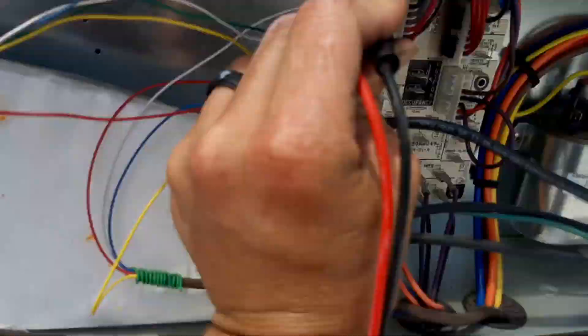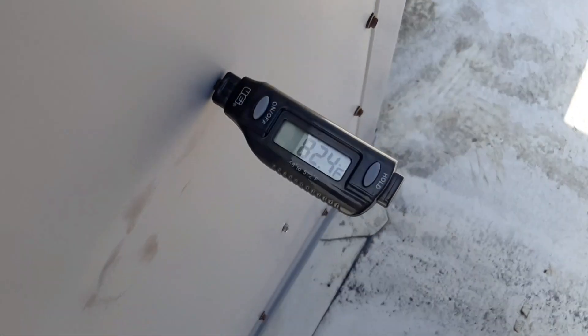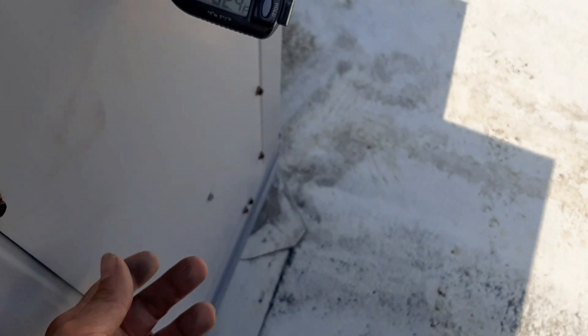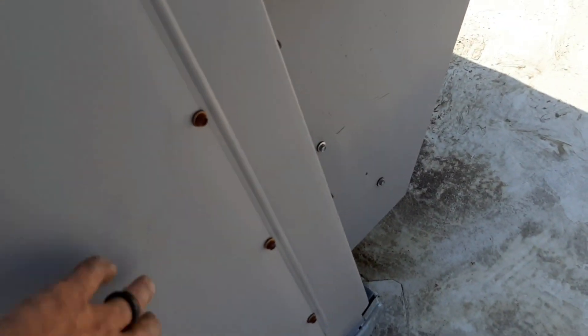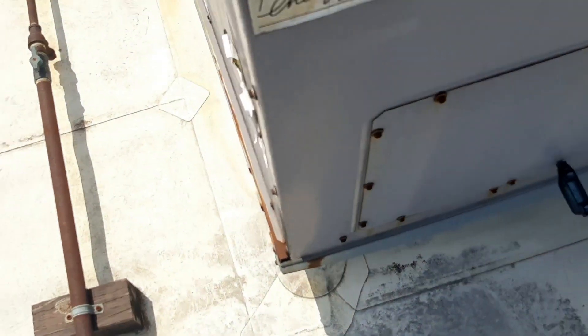26 volts — never get tapped right, I don't know why. Alright, let's go get our stat turned back on. I'm showing about 82, looks like 76 in space. It is ducted in — I was getting higher readings from down there because I'm actually being blocked by that economizer. So 82 — we've got a good supply temp. It just kicked in so we'll give it a minute.